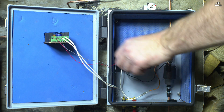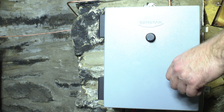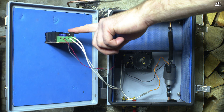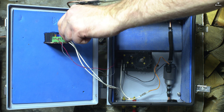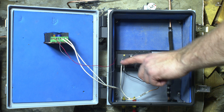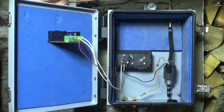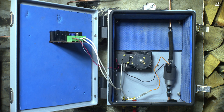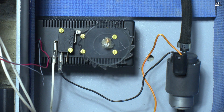To give you some control of the speed of this, on the front of the case is a small adjustment knob, which is attached to this very simple DC motor controller from eBay. You provide constant DC voltage to two of the terminals and out of here comes a control current to the motor inside the box. So if I just turn this on slowly, you'll see the wheel starting to turn. The further round I turn the wheel, the faster it goes.